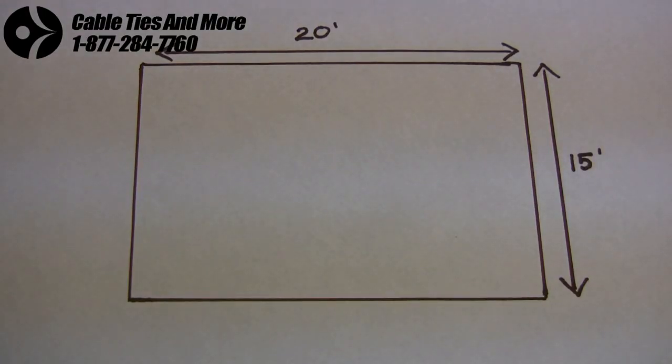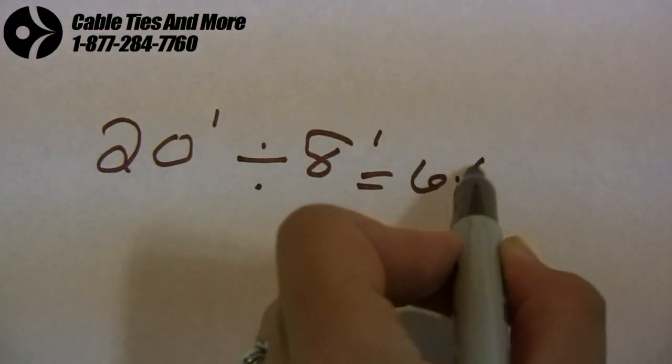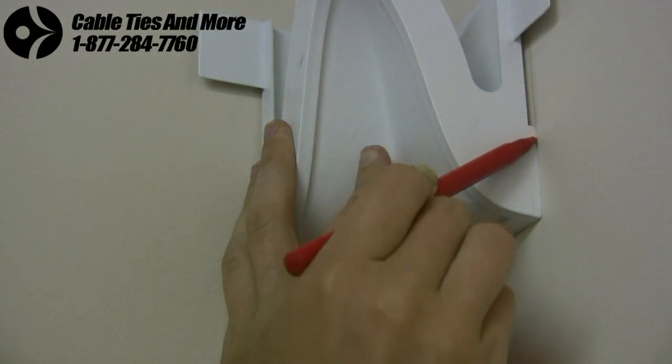You will save on length with the splice over the connector. Just ascertain how you will divide your lengths up for cutting, see how many splices you require, and install with no additional cutting after initially cutting them down to length. You can secure the butted lengths with the splice behind them by using caulking. First we want to know the length of base that you're going to need, and we'll do this by tracing reference points on each side of the corner joints when they are placed flush with the ceiling. Do this with all corners.